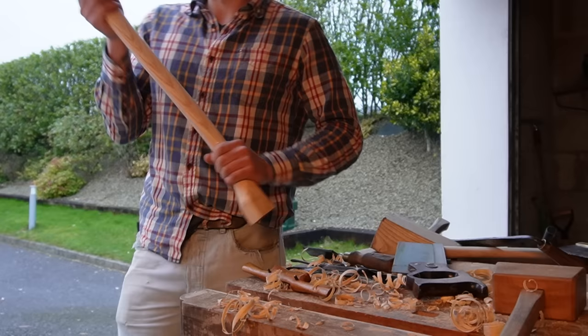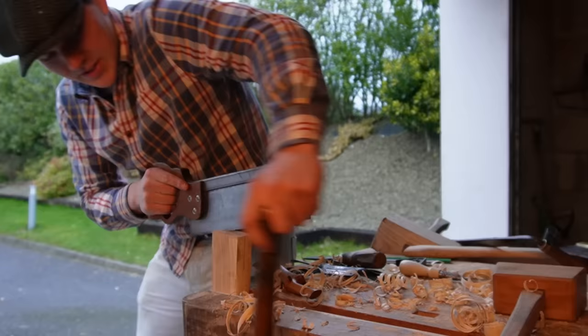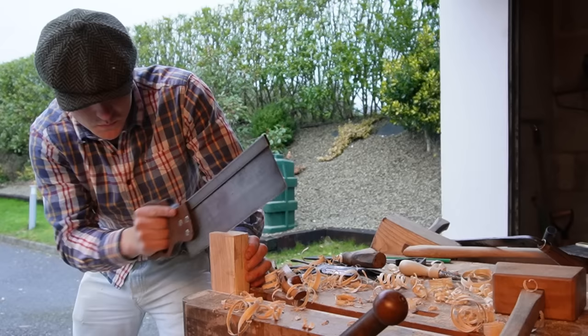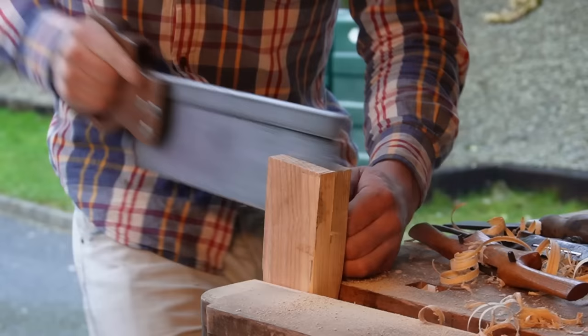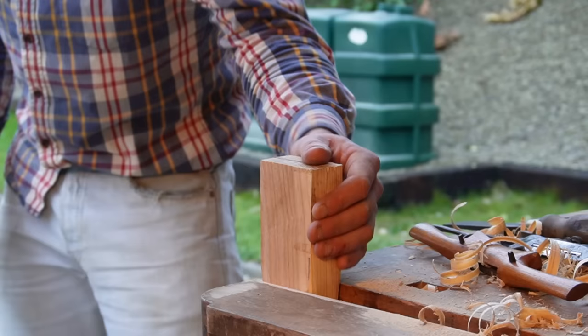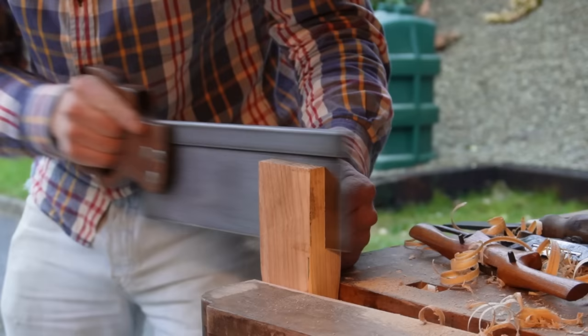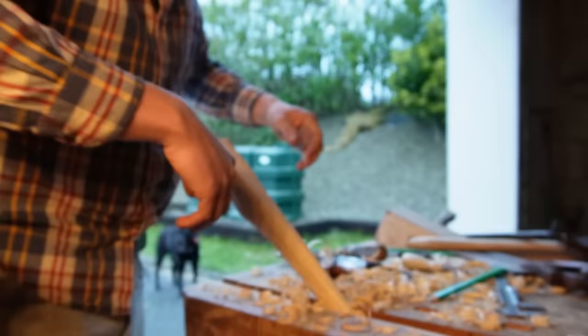So I'm fairly happy with the shape the handle has taken. What I'm going to do next is cut the slit for the wedge before I've even shaped out the part where the head is going to sit on. So we'll grab our tenon saw here, lock the vice a bit tighter, and fire away. I'm just going to keep going maybe a few more millimetres and then stop. So I'm just rounding out the edge there — same old story, just a lot of work with the spokeshave being done.